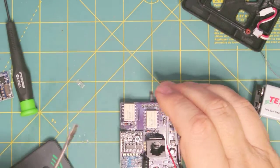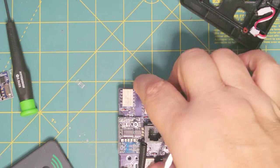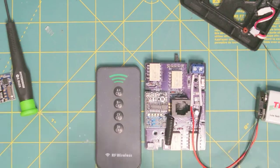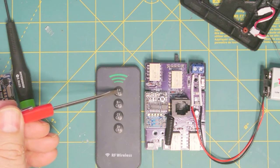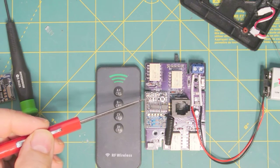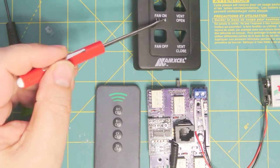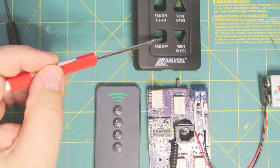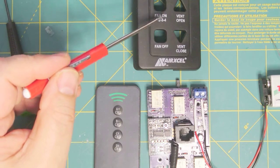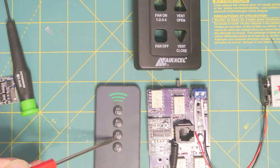Now we want this to be momentary. Depress the button again, hold it, turn it on, let it blink once, twice, three times, then let go and turn it off — so now all channels are cleared and this is set up for momentary. I'll explain how the button behavior works: Channel 1 shows up as A, Channel 2 as B, Channel 3 as C, and Channel 4 as D. That corresponds to channels 1, 2, 3, and 4. However, that does not line up with the channels on the remote. On is Channel 4, Open is Channel 3, Off is Channel 1, and Close is Channel 2. So to program Channel 1 we'll have to use button 3, and so on.